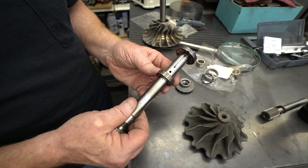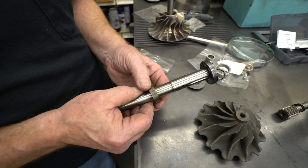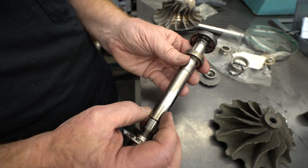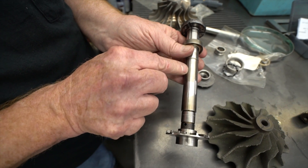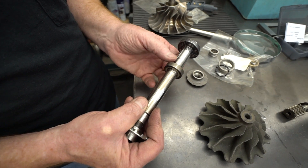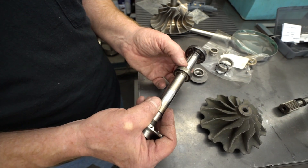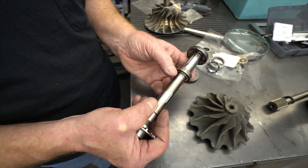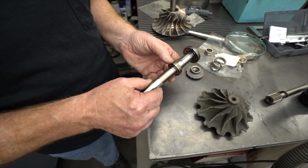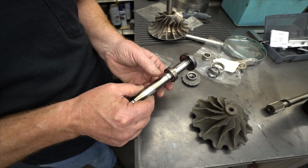But this all is critical measurement. This is Rockwell 68 to 72 in here — it's hard and it's got about a 5-micro-inch finish. It has to be precision. The shafts actually come in different sizes; this one measures 0.7732. So we'd want probably a bearing that was properly gauged to fit this shaft correctly. You can't always see that and you can't always measure it, so you have to guess sometimes. But most of the bearings are only made in 4 tenths total size variance, with 1 tenth increment in each one. Each manufacturer marked the bearings when they made them.